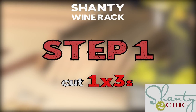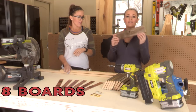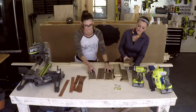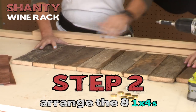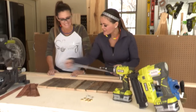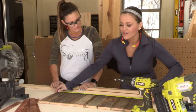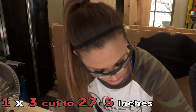The first step is to cut the boards that are going to be on the front — we're going to use eight of these, cut to 12 inches. We already have these cut down, so we'll go ahead and lay these out. We have our eight boards laid out, and we're going to get this measurement because 1x boards always come in slightly different widths. This one is going to give us 27 and a half inches. We've got this 1x3 that's going to go behind them to attach them together, and we're going to lay it on the back and then just mark where we're going to make our cut.